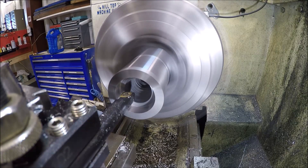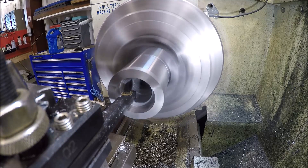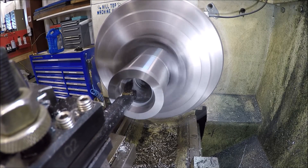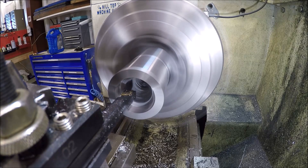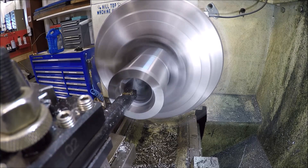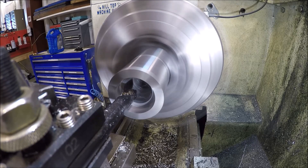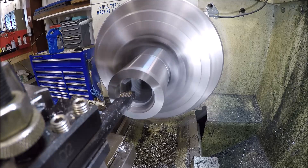It's time to start chewing out the bore, make it tapered — just taking small bites. It's only a half-inch boring bar and I've got a good couple inches to stick out, and I am not in a rush. I'd like to only have to make this part once, so just taking it easy.